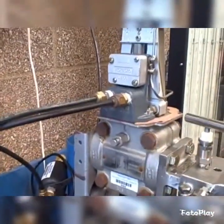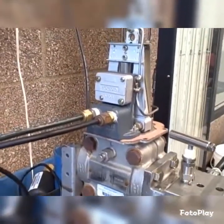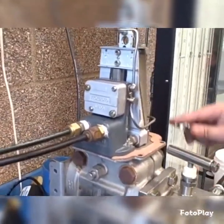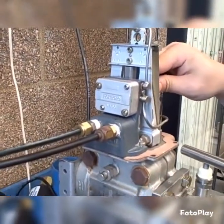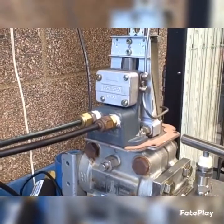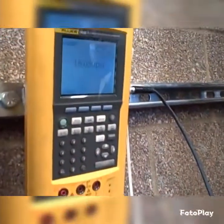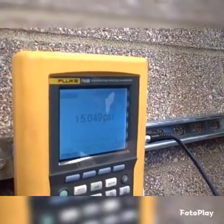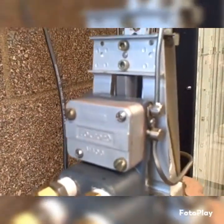However, these transmitters are capable of much greater precision. It's not unheard of or impractical to shoot for plus or minus one quarter percent of accuracy for a transmitter in good condition. You're going to hear the hissing in the relay, the air that's bleeding past, and also the air that's bleeding out of the flapper-nozzle assembly right here.